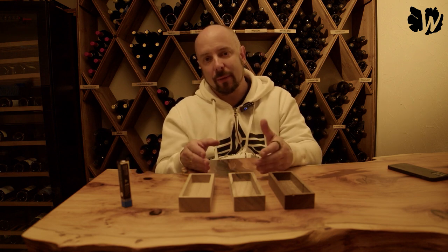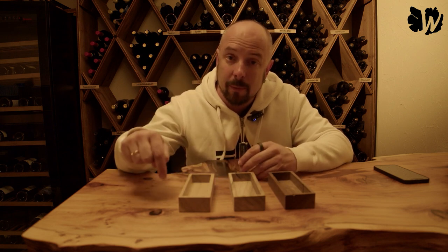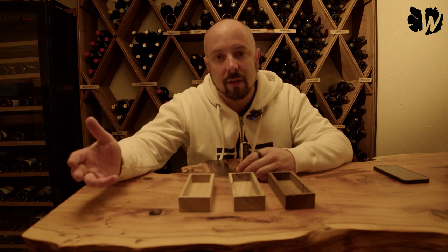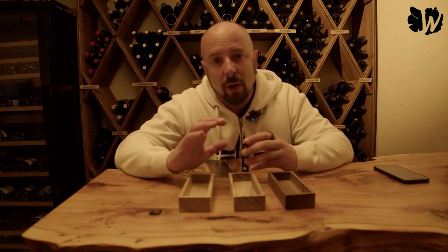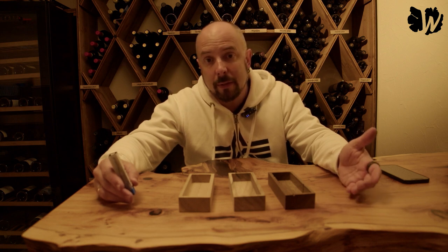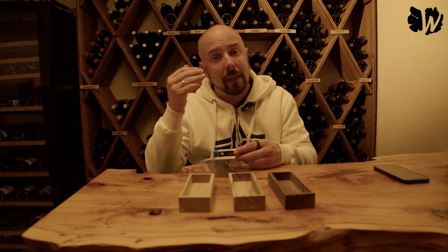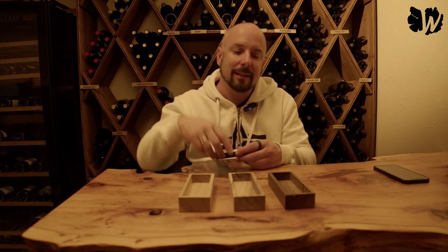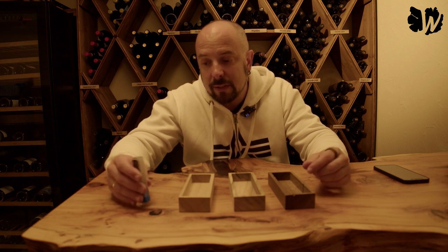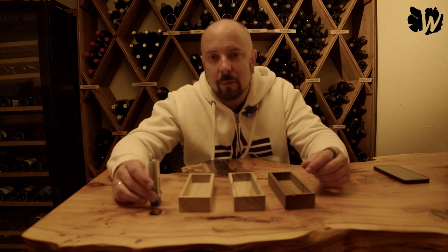The question is, does it really make sense to use it that way? What is this bit good for? I would recommend buying this bit if you need to do deep pocket cuts that are small — for instance to apply hardware to your wood such as door hinges and other things where you need to go deep but for small areas. You don't want to do a large pocket cut with it; that's just cumbersome. But if you need to remove up to 20 millimeters of material for smaller areas, then this is really nice. You can save time and make really clean cuts because you don't have to do multiple passes. So I am going to use this — I'm enthusiastic to have that option for smaller pocket cuts.